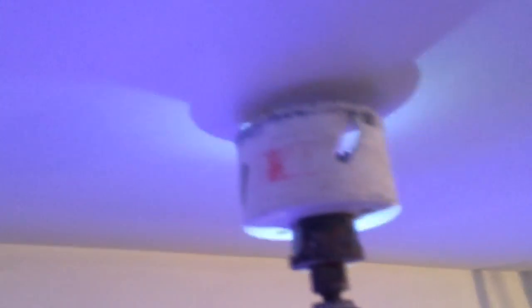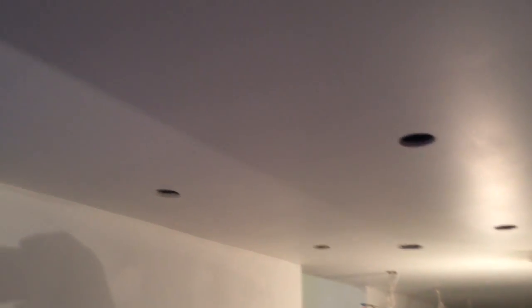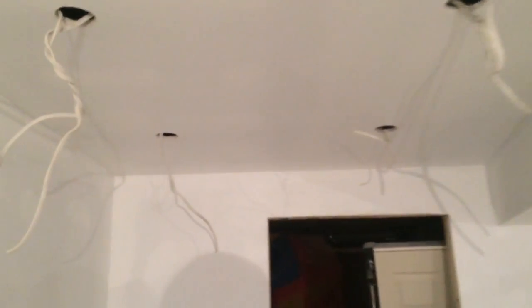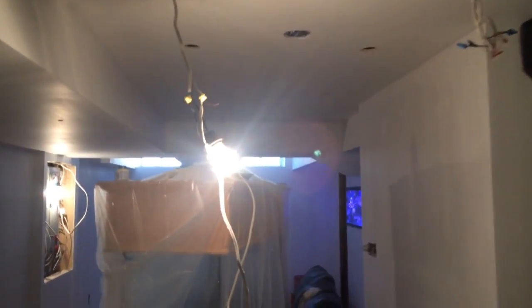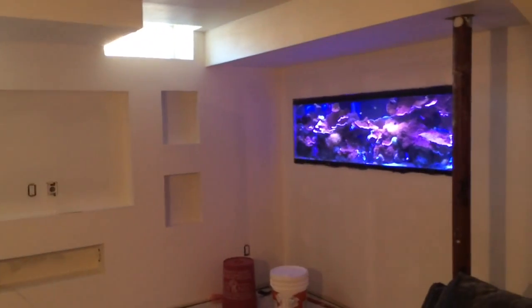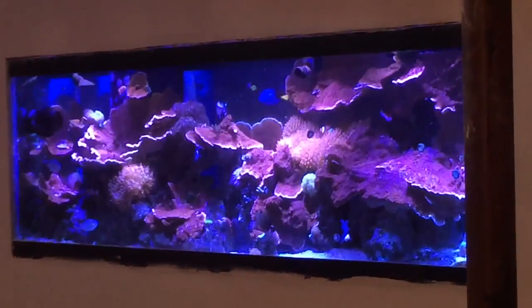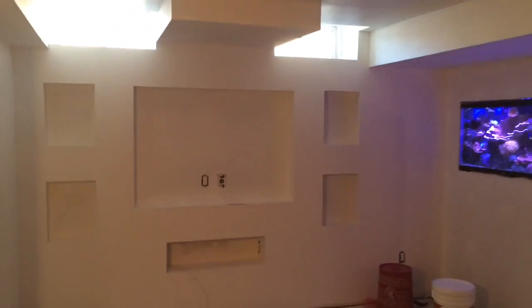I'm pretty much ready to drill the holes in the ceiling for the pot lights. I just finished marking them all out according to what I had drawn beforehand — then I'll pull down the wires and make the connections. You can see we have quite a few pot lights here — drilled with a hole saw through the drywall according to my measurements, all in a nice straight line. We have approximately eight on one switch and another eight on a second switch. I'm going to mark out the remaining pot lights, drill the holes, pull down the wire, make the electrical connection, and install the pot lights.